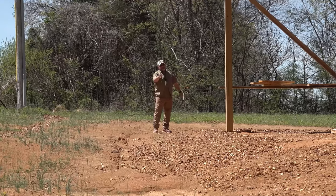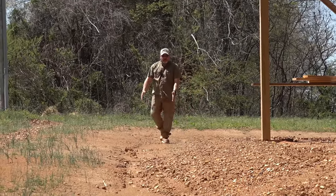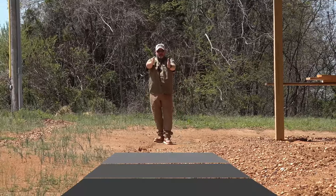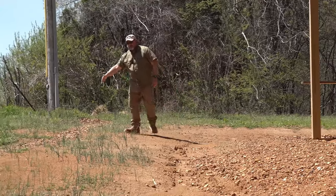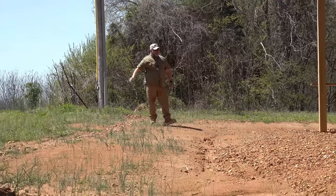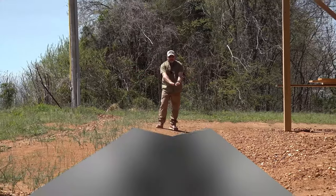So you're at the back side of the barn now. We want the water to continually go down and around and out this way towards a natural drain to the back of the property. We have the power line here that we put in underground. So we've got plenty of room to work here. There's nothing over here to work with. So what we'll do is end up making a nice gradual slope.